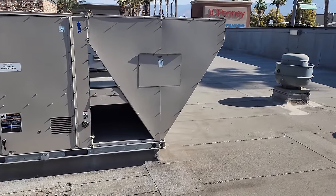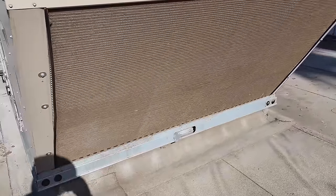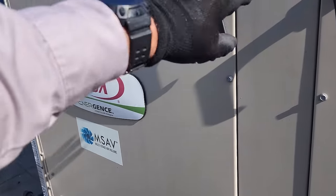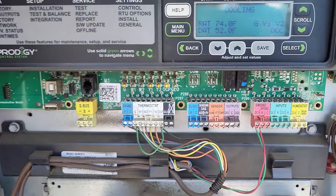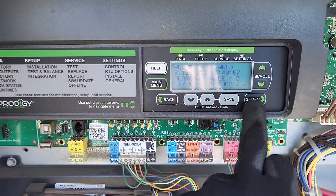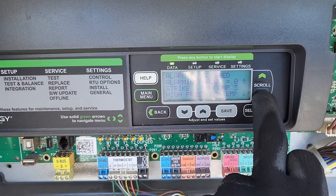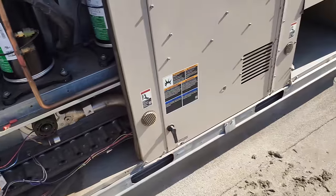It is Saturday, August 13th. We have an emergency service call that came in last night for a kitchen AC not working properly. The condenser is pretty dirty, so I bet it's going to be a high-pressure code. Opening it up — this is a Lennox package unit. All stages are calling and it's running right now. Going to main menu, data history, alarms — yesterday, strike three on compressor one: high pressure. So it's high-pressure codes. It's running right now but it's probably shutting off on high pressure as the day goes on.